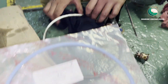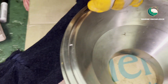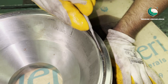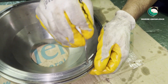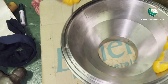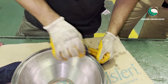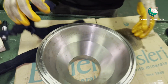This is how you remove the old seal ring. Now, to prepare for fitting the new seal ring, you have to clean the seal ring groove area. You can see a lot of damage — small hit marks — all of which happen because of removal using the wrong procedure. Remove all carbon deposits and impurities with the help of a sharp welding rod so it can clean the corner dirt. All those hit marks are because the screwdriver hit directly over the body of the seal ring groove, which may damage the body.